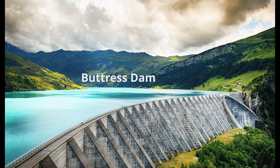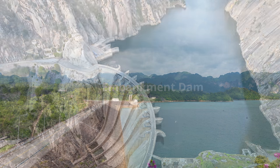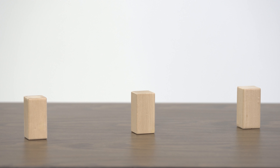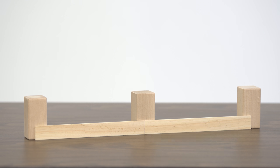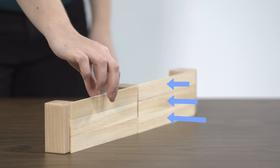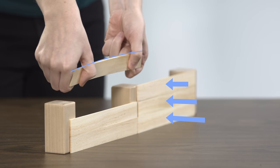Common strategies for doing so include buttress dams, embankment dams, and arch dams. To make ponds for mills and to control water elevation in rivers, another strategy is often used. It consists of vertical piers with straight horizontal members between them. The water pressure that pushes against these horizontal members is carried by bending, and so these members function as beams.